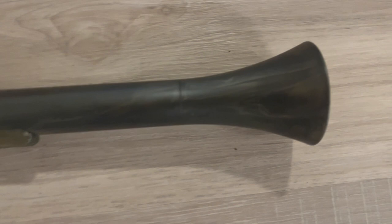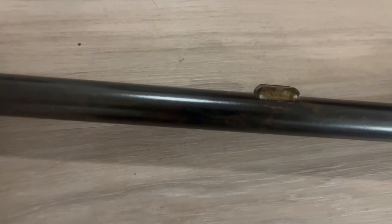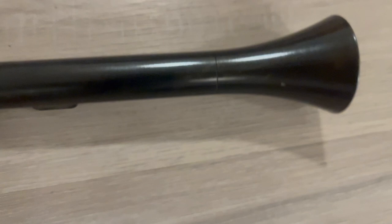This is what the barrel looks like after two applications of Permablu. It's a little bit spotty, so I applied a few more — and it looks like this after five applications. There's still a little bit of spottiness left after brushing it with steel wool, but I like that because it makes it look a little more ancient and authentic. Very nice.